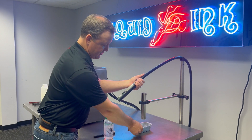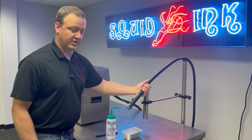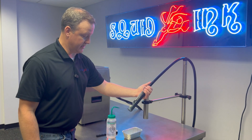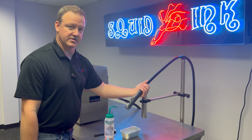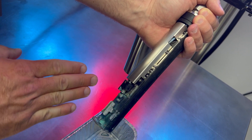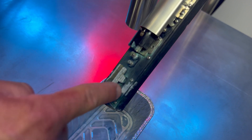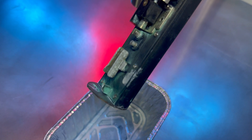This also comes with each printer — we have a little catch tray. When we do wash the head off, we'll catch any of the MEK that drips off the head in this tray. So we have our printhead out of the sleeve and we're not jetting. You'll see we've mimicked having some ink on the printhead here, on the deflection plates, and a little bit up on the electrodes.